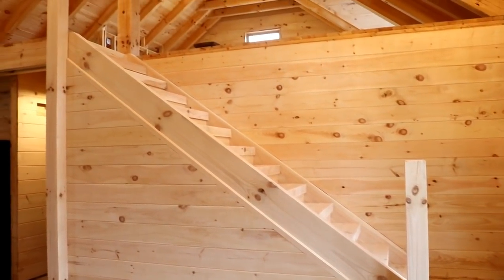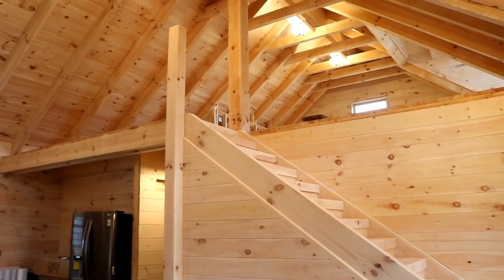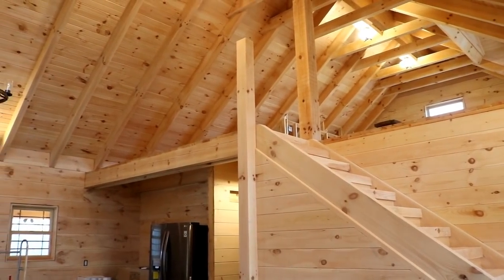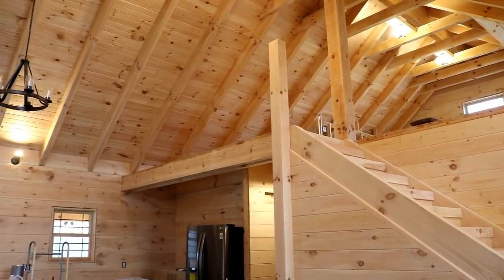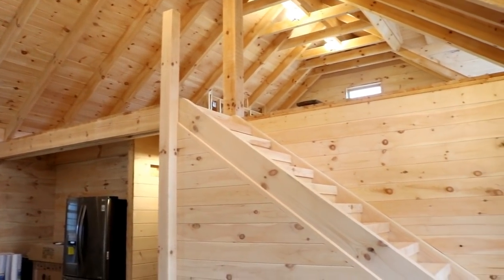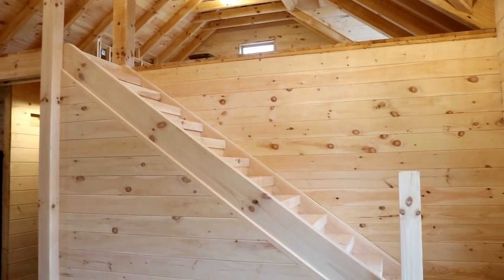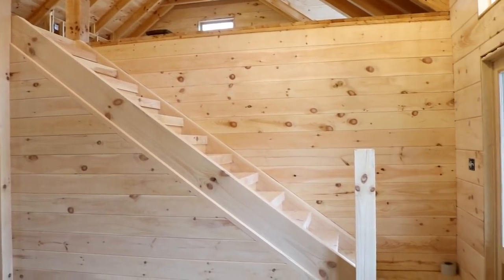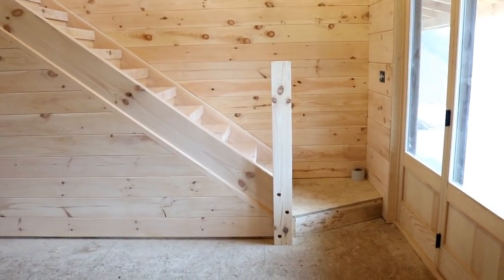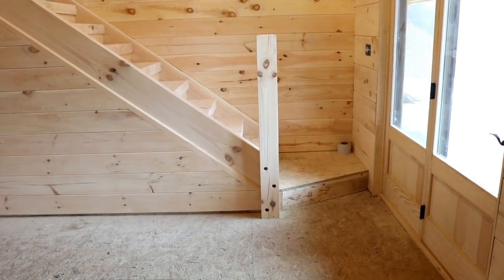As you can see, we don't have any handrail on the staircase yet — we'll be working on that soon. It will have some handrail along the staircase and on each side of the loft as well. We're making the spindles for that handrail out of three-quarter inch rebar and painting it black, so that'll be a future video. For right now, this is the timber frame staircase, and I'm sure in the next video it'll look a lot better once we get it all polyurethaned and coated.